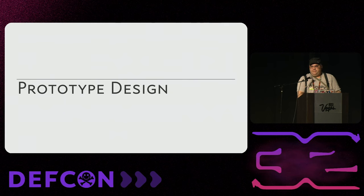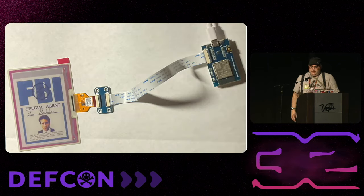Now I'm going to go into the prototype design I made — this is the more interesting part. On the right is an ePaper ESP32 circuit board that connects to the ePaper device. The fidelity is much better; the white is still off-white but it's much higher resolution. The purple part is the bezel, the orange part is the physical display connector, and the middle part is a shim that takes one connector and adds it to another — that middle part is also part of the programmer.